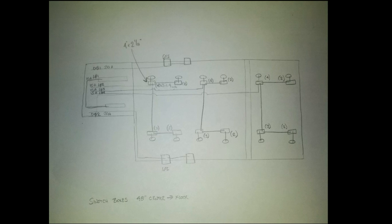Here's a quick shot of just the planning phase. The best thing to do is draw out your space and make sure that you've got all your circuits accounted for. Then come up with some type of percentage for growth to add on top of that, and make sure that you're putting in a box that's got enough breakers that it's going to work for you.